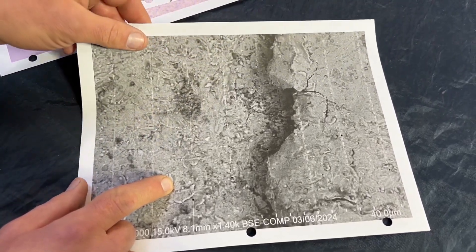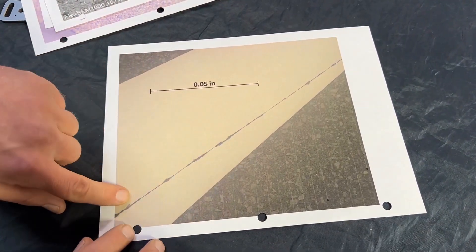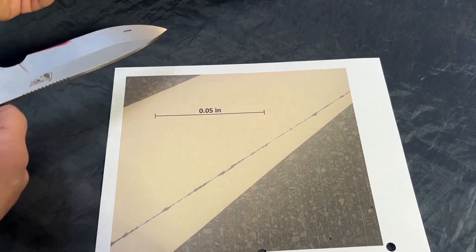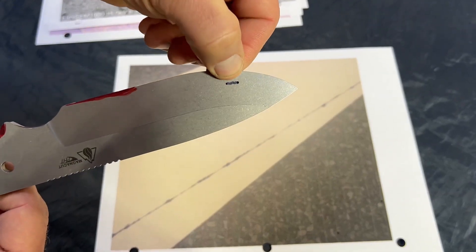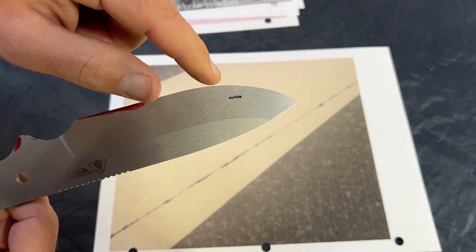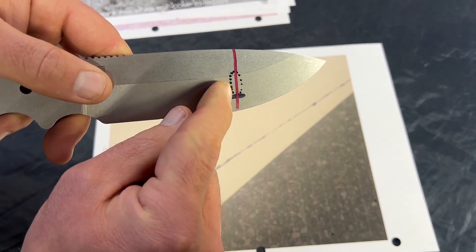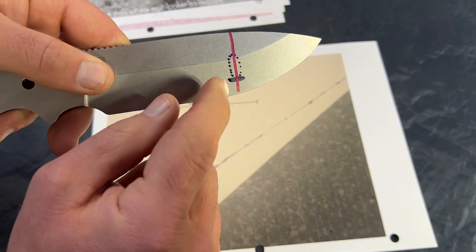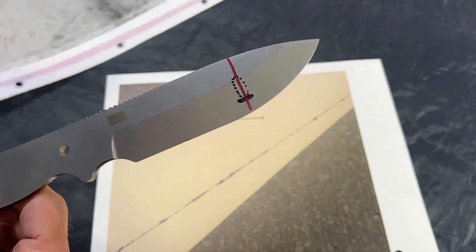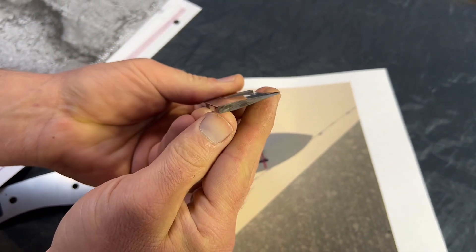After I made that original video, we got a follow-up photo from the lab here where they cut into a part. I just want to explain what we're looking at here because all this ragged edge here is just kind of sandwiched into the material. With these early images, we were looking at the surface right around the anomaly and in that region on the surface. After completing their investigation of that area just to see what that was looking like, what they did was bisected that where it was visible and cut it in half, which we knew there was probably going to be a longer anomaly in there just based on previous observations on the surface grinder.